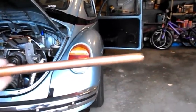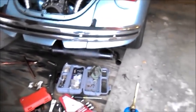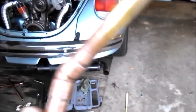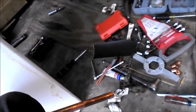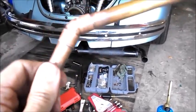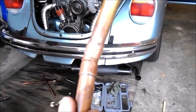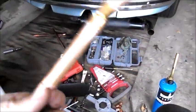Temperatures are fantastic. I've been working on soldering my pipe stuff up here, and I think this one worked pretty well. I'm no soldering pro, but I do know enough to know that when I was doing that joint right there, both sides, I was like this one's just not working right. It turns out I've got some flux — ancient flux. I didn't realize that flux goes bad. I've done this a hundred times through my life, being a homeowner and sometimes doing plumbing. The only thing I could think was I needed new flux, so I got some new flux. There it is — my old solder. And when you put it together with fresh flux, everything begins to work. This side worked fine.